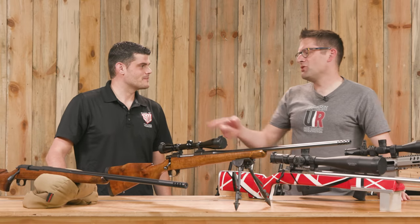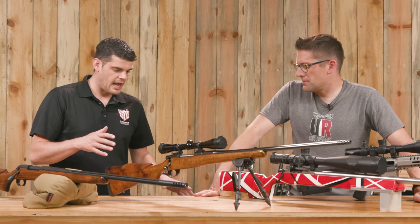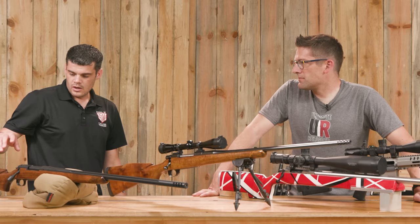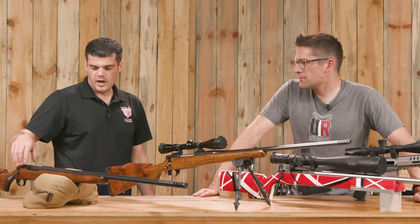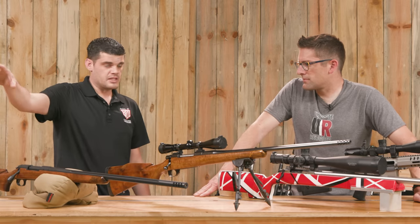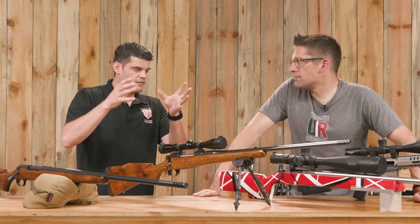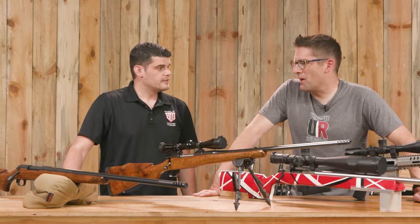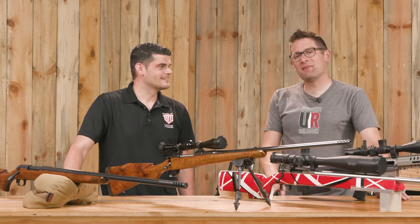This stock was way more rough than the others — almost like a two-by-four block, so I had to do all the mill work to cut the barrel channel and do as much inletting as possible on the mill, then fine-tune with inletting ink. Basically just a chunk of wood to start. Four different rifles, four different stories, and a lot more to come — there's always that next project.